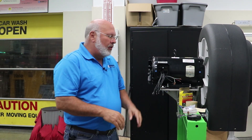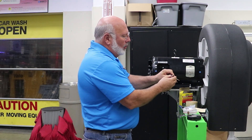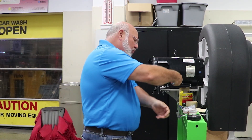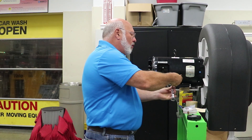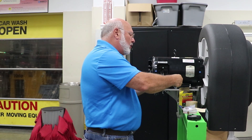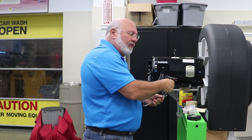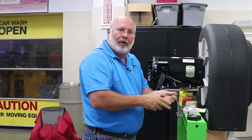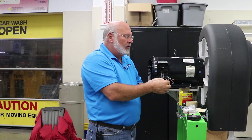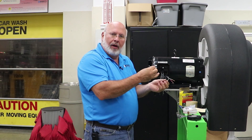You need something to strip your wires with. I have one here already insulated and one on the unit loosened up. A couple of small wrenches is all it takes. Depending on whether you're high voltage or low voltage, you need to buy the right Thomas Betts connector to handle the right gauge wire for your unit. The motor wire is always going to be the same, but the wires feeding it may be a little bigger or smaller, so you may need a different connector depending on how many wires you're putting together — normally two, but in some wiring configurations you have to put three motor leads together to make the connection proper.